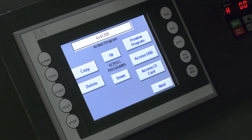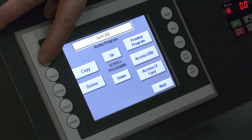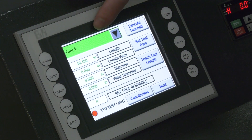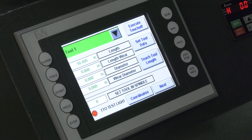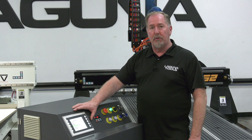The program screen lets you access programs from the USB stick or from the internal memory inside the controller. The jog buttons allow you to position and move the spindle and gantry around. The alarm button lets you view the status of the machine — if you have any alarms it'll bring those up so you can reset the machine. The tool menu tells you which tool is active and the tool length; you can program the machine for tool wear and perform a tool touch-off to teach the tool length. The start button starts any active program, and you can hit hold to pause a job or stop to completely stop it.